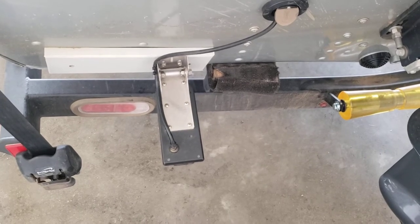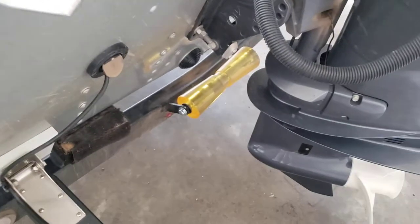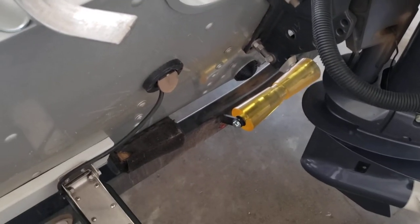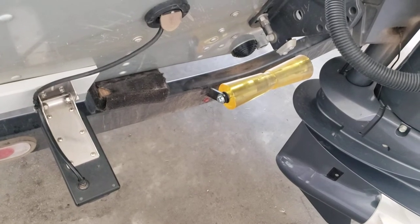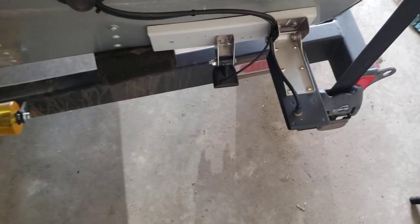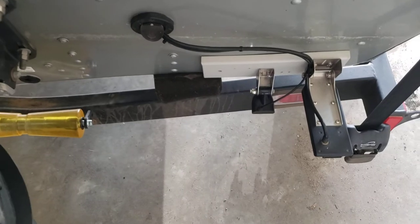Now you're saying, why do you need $700 worth of transducers on the back of the boat? Well, the answer is that I really, really like my side imaging. When the motor is trimmed under all the way, it can actually get in the way of the imaging. Since I've got an imaging transducer on this side and one on this side, there's a Y cable you can buy from Humminbird that splits the signal so that the side imaging transducer on this side only gives me the right side, and the one over there only gives me the left side. So, I don't have to worry about the motor blocking part of the side imaging beam.